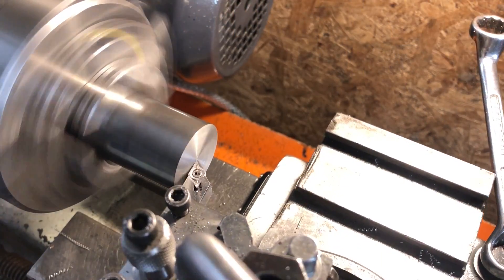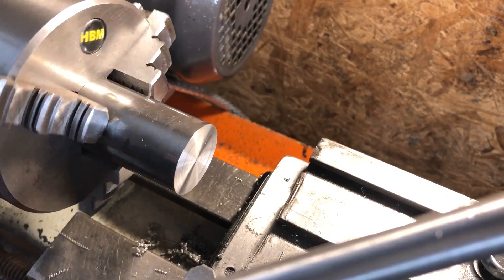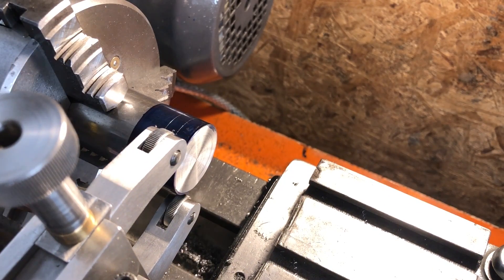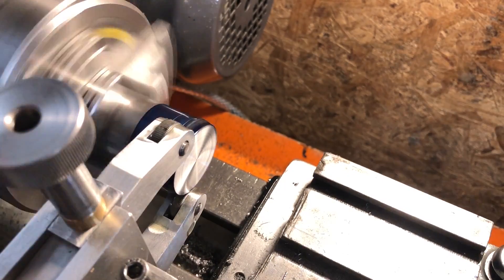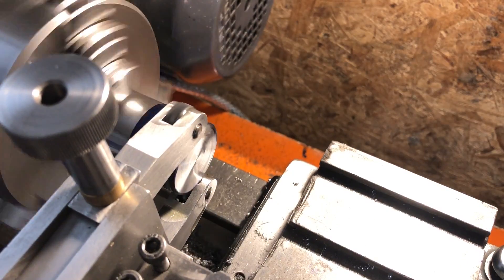The nut is a simple piece of turning, and all of the features can be completed at one setting, so there are no concentricity worries. The large diameter is specified at the supplied stock dimension, so after a facing cut I can jump right in and add the knurl. When doing this I prefer to have a straight knurl on items that are to be rotated only, and a diamond knurl for parts that are to be pulled, although I'm sure it makes no difference at all.